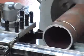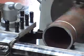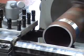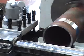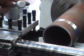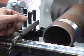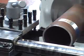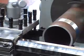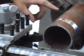It's a bit of an intermittent cut, so I'm probably going to take two cuts before it's finished. I'm not so concerned about the outside diameter, but I want a good cleanup. I've still got a bit of rust on the surface here, and that's going to adversely affect the rollers, so I'm going to take one more cut.